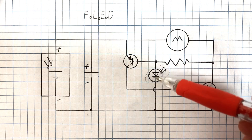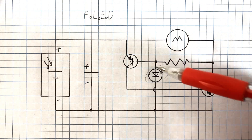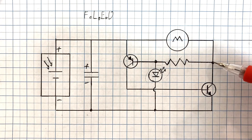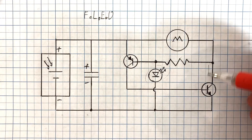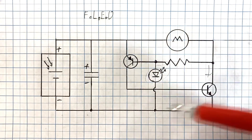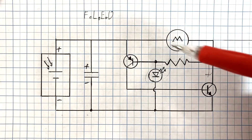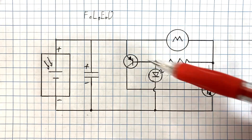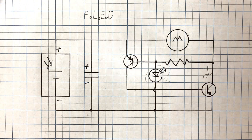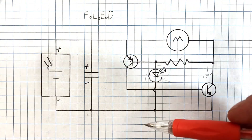When the flashing LED turns on, it pulls quite a bit of current — still a tiny amount for this circuit — and it pulls some through a transistor, which starts to conduct. Positive flows to a second transistor, which also starts to turn on. As this happens, it pulls a resistor down to ground, which turns on the first transistor more — a self-propagating loop. Once fully engaged, the motor drains the electricity from the capacitor and moves for a short time until the capacitor voltage drops to about 0.7 volts, at which point the transistor gates disengage and the circuit resets. This type of circuit is called a solar engine — a simple version that charges to a certain voltage, discharges to another, and repeats.